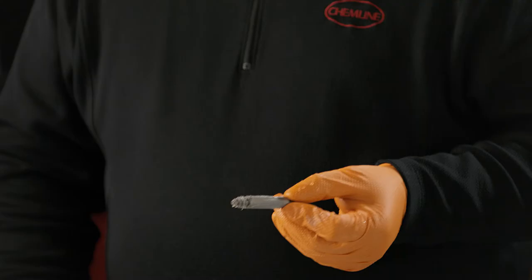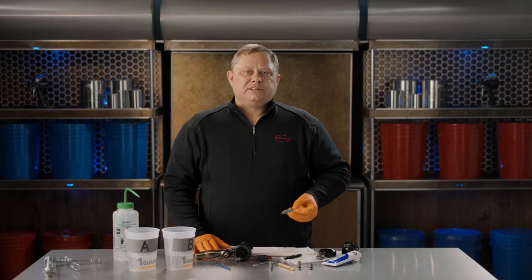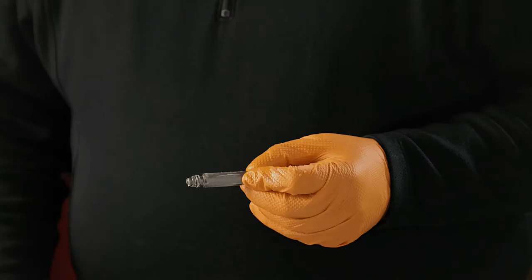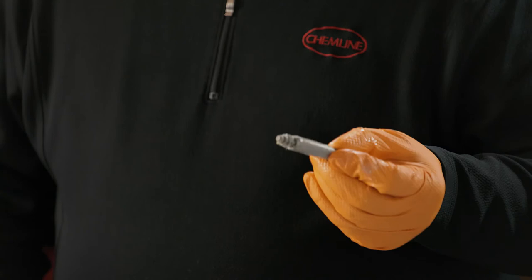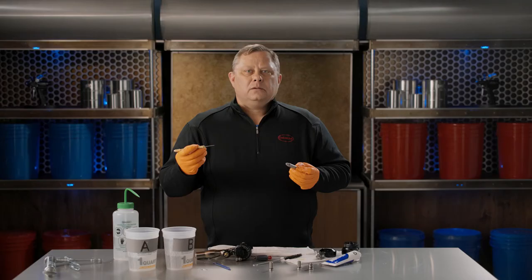Most mix chambers will last approximately 20 drum sets. If you notice any scratches, you should replace it or refinish it. Over time, the orifice is going to expand just through erosion — it's hardened steel and it will wear out; they do not last forever. This will throw your mix ratio off if one orifice gets larger than the other, so you should always check it with your drill bit. Seals should be replaced every 20 drum sets.